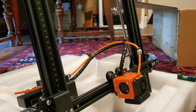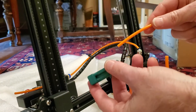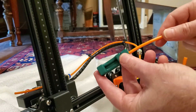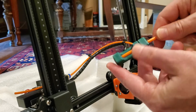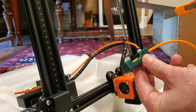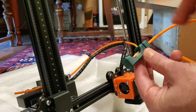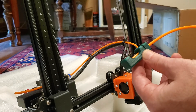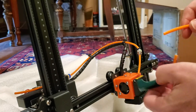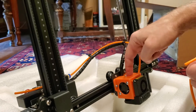The concept is the same. You're going to take your tubing, whatever you're using, load up your jig, and push it all the way in. You're going to take a straight edge or an X-Acto knife — something very nice and sharp — and cut straight down all the way through the tubing to get a nice straight cut. This gives you a 36 millimeter length of tubing that then goes down into the hotend.